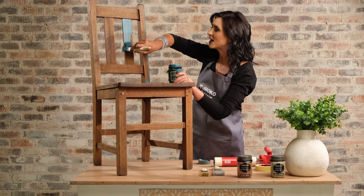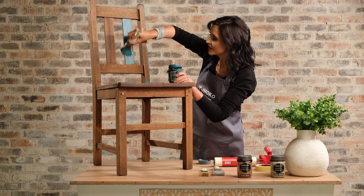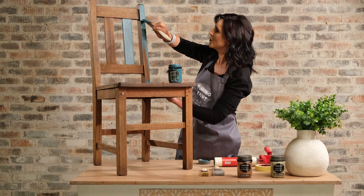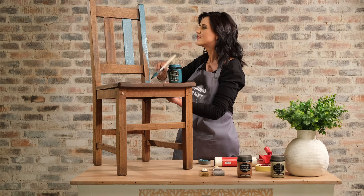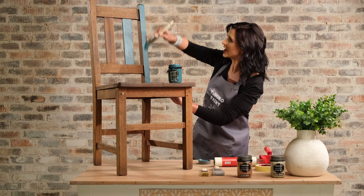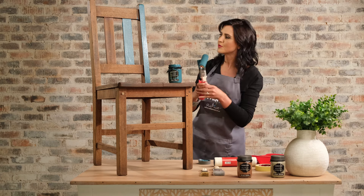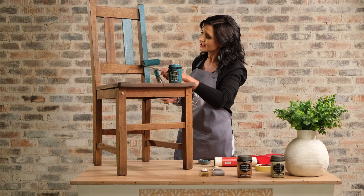I am going to work with the grain of my wood using my paint brush and paint evenly. You want a generous amount of paint on your paint brush and don't want any tears occurring on your surface — that is where there's too much paint overlapping in areas applied unevenly. Especially when painting the legs of tables or chairs, I paint with my paint brush on flat surfaces and while the paint is still wet, I use my foam roller, very lightly applying pressure to even out any streakiness that might be visible.